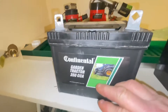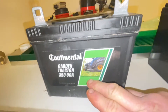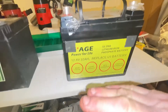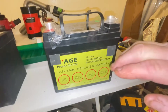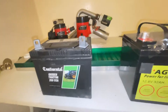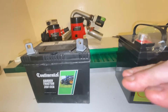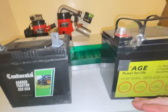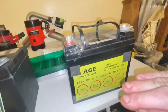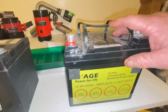When I bought this I wanted to make sure it had the higher cold cranking amps — I could have bought one with 280 cold cranking amps or 350; 350 gives me a longer run time. The nice thing about these batteries is they maintain high voltage up to a certain point and then dramatically drop off. I ran this with my big pump last summer and noticed the drop in voltage — it would run and drop, run and drop. With the lithium iron phosphate, it maintains a high voltage for a long time and when it drops off, that's when I grab my second battery.